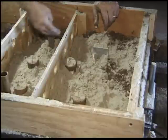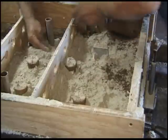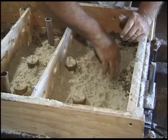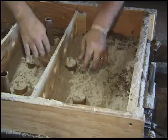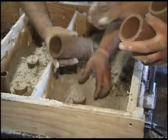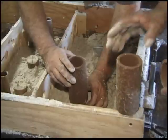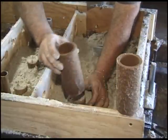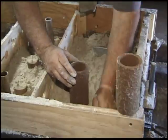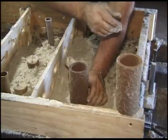Okay, give me some more right in this area here where you've got that roll. So put it right up in that roll. To get tight down in there, you got these different sizes. Yeah, 6-inch go on the long one. The metal just eats right in or washes that sand away. That's the long one. You got sand mixed into your metal. And so it's important that you get those corners sharp, and that's something that takes time. Okay. Another six. Five? Where's the five?